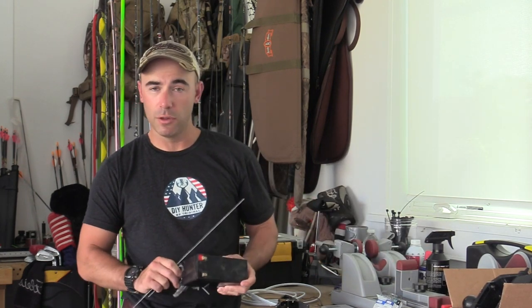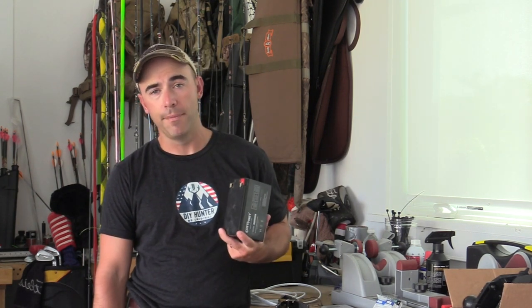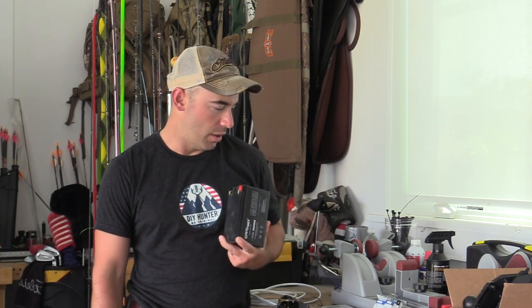I'm going to make this a little bit modular. If I'm in a bigger boat with a motor that already has a built-in battery, I'm going to put in ring terminals with a longer section of wire attached, and I'm going to have a disconnect with nylon male and female clips so I can wire in the male clips directly onto the battery. That way I can take this battery, the monitor, and most of the wiring and put it right into a little soft-sided cooler — that was $25 on Amazon. So stick with me on this project; it should be a pretty short deal but it's going to come in quite handy.